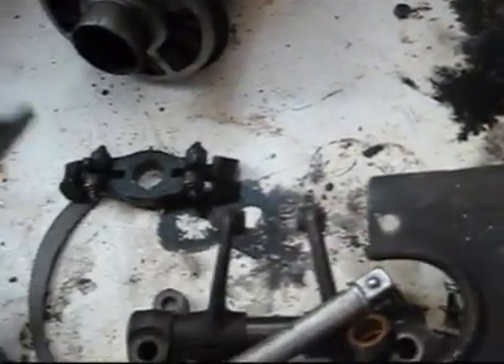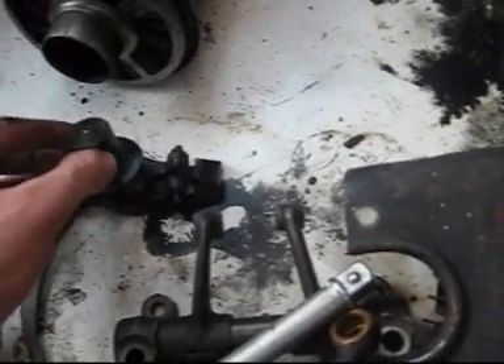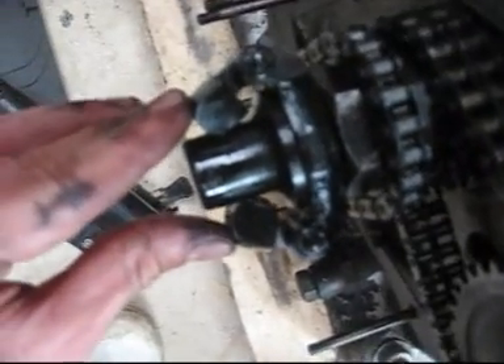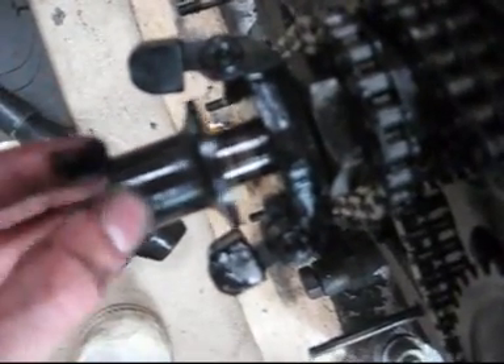That's a pretty simple thing to put on. It just goes in there, and that goes under that other little piece. I just put that on, and you can see it's quite a simple mechanism. So if the engine's spinning too fast, these two counterweights fly out, and it pushes this piece here out, and through a series of linkages it connects up to the injector pump.